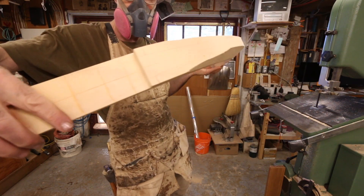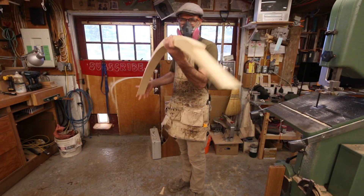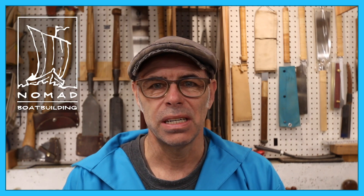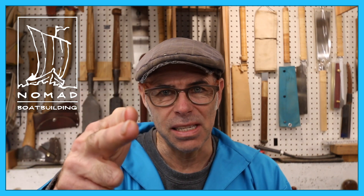That finished beveling isn't super pretty, but it doesn't have to be — we can do a little bit of cleanup at the bench and then it's ready to go on the mold. We have our stem and stern post ready to go. The stem is ready to go onto the mold and get finished up once the mold is set up. The stern post will get fastened to our transom, and we'll take care of that in the next episode. Thanks to everyone on Patreon who supports this channel — links in the corner and in the description. Remember to subscribe, and keep your stick on the ice!